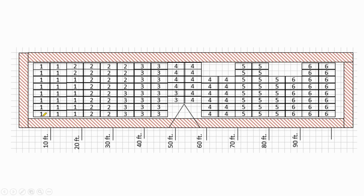So let me give you an example. This is what I would call the snakes in a basket approach, where here's circuit 1, here's circuit 2, here's circuit 3, and we can just kind of see that. And maybe here I'm at the end and I have to stretch that. And the way I would do that is underneath the array, instead of landing the optimizer here, I would land it here. And the cable whips from the module would still reach. And then the whip from the optimizer to optimizer would still reach, so I wouldn't have to build a jumper cable. So you can do a little bit of strategic placement of this stuff if you really want to. But this is the snakes in a basket approach, where you're really just trying to do the most compact string layout that you possibly can, in order to reduce the number of circuits on your rooftop. Fewer circuits means fewer breakers, less install time, less material cost. Great.